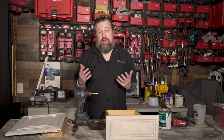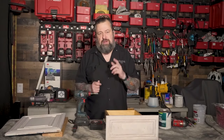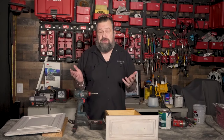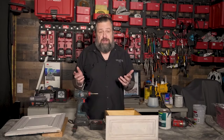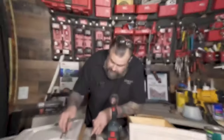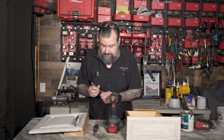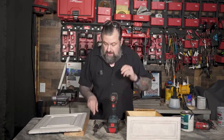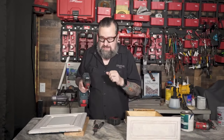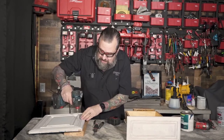We've got everything primed and it's dried really well. The next step is going to seem a little out of order, but it's a good time to drill the hardware. If the hole is off a little bit, I can refill it and fix it without having to go back and paint again. I just line the hole up on there — that's perfect. Now we're going to get the drill out. You always want to drill from the front because if there's a little bit of blowout, you want it in the back — it's going to be held by the screw anyway.